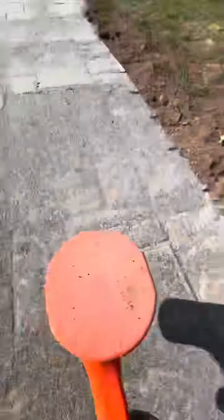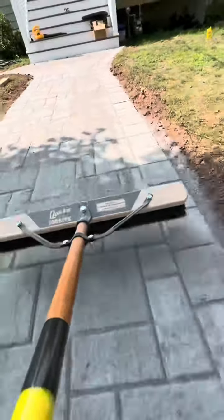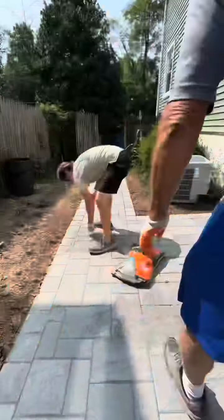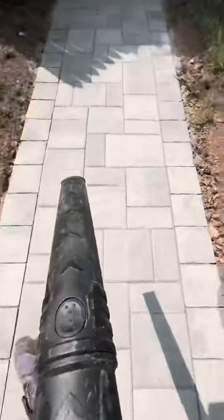Just a little different view — tapping it down, going over with the compactor, getting everything cleaned up. Once this is done, we clean it with a fine tooth comb, slightly below the paver, and we are ready to begin our water phase. As with everything we do, we believe the wet look is the best look.